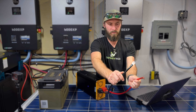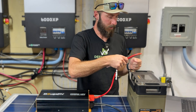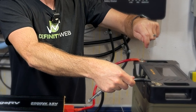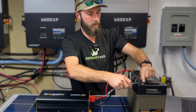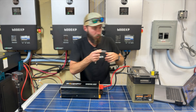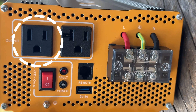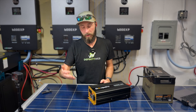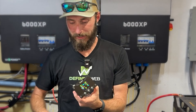You don't want these guys to touch — although nothing happened right there, still don't want that. Now that we've got that set up, let's get it connected to a battery. Connect up the positive first. A little bit of singeing there — I didn't like that. I always make sure it's turned off; in this case it was. Once we've got the battery connected we can go ahead and turn it on. We've got our two AC outlets, our 15 amp and our 20 amp, and terminals on the front where we can hardwire into our RV or panel. Let's hook up this communications cable. Instantly powers up — that's actually a really nice display. It's super bright; I didn't expect it to be that nice.